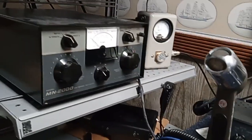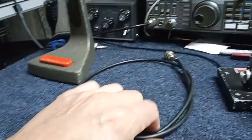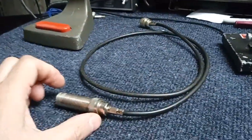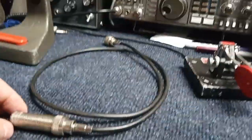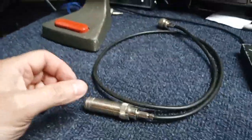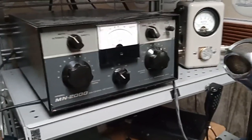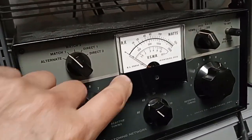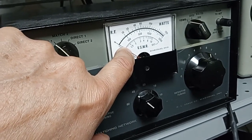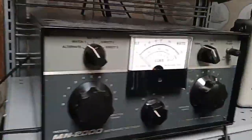It's real easy then to put a classical old inline SWR meter with a short piece of cable — about three feet — that extends the transmission line. The initial condition was that this meter read just a hair above zero, between 1.0 and 1.1, about 1.05. Boy, that's a great SWR. That should work well and the antenna should get out great.